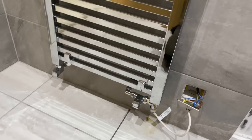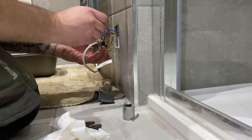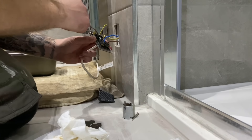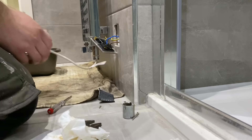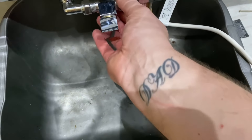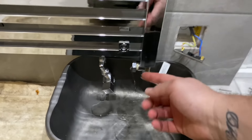I'll disconnect the cable from inside there, isolate the rad with the valves, take the valve off, take the rad off, empty it out and remake this fitting. So we shut the rad off on the valves, open it up, drain it down into the bowl, open the air vent at the top to release the water, and whip the rad off.